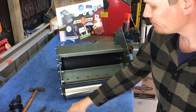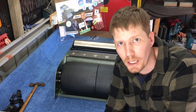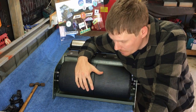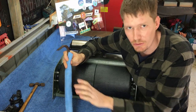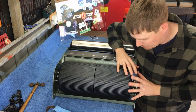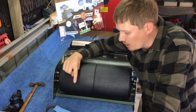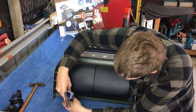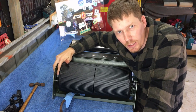First of all let's flip the mower upside down. Now we've got the reel mower upside down. Our next step is to position our pivot point - our wedge. I like to get a bit of cloth, wrap it in cloth just to prevent scratching of the mower. The drive side - the side with the gear - is the fixed side. The non-drive side is the adjustable side.